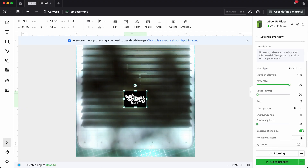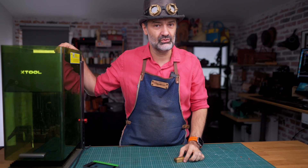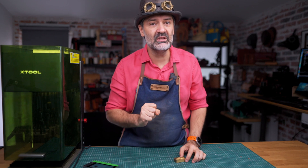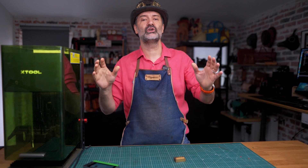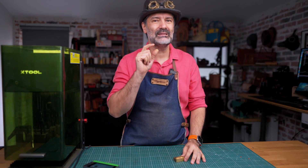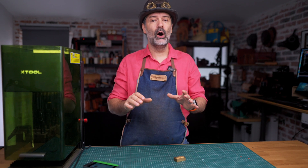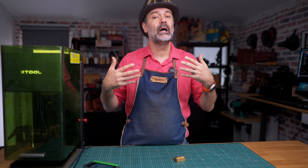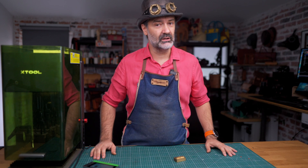Back to our settings, just leave them at one and 0.01. This will do the job just right. With these settings, I get about 3.3 millimeters depth on solid brass. If you don't need that much — let's say 1.5 millimeters is enough for you — cut the number of layers in half to 50 or something like that. Or do your own experimentation and please share the results with me if you get better, faster results.